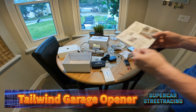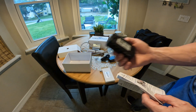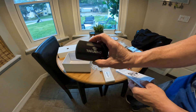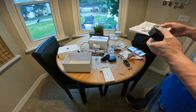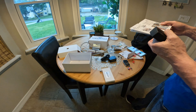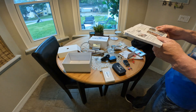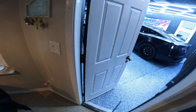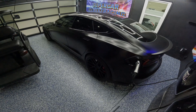The second step is selecting a mounting location for the control module — that is this unit right here. We have a pegboard or we can just put it on top of the garage door opener. Make sure the power adapter will reach. Locate the module on the side of the door opener, and mount the three-track door sensor. For this next step we have to move out to the garage.